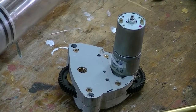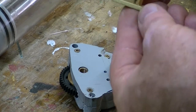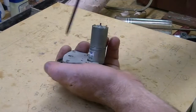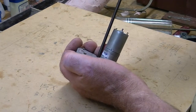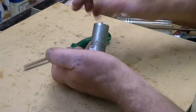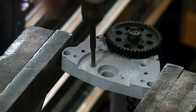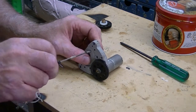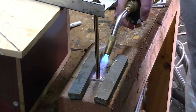It's all about arranging the start and finish stops for the piston. Good idea to clean the lathe between instances. A new motor is bolted on, and a piece of brass has been made to hold the tube with the slot. Thinking through how to hold that tube onto the back of this gearbox, which is currently holding together with the equivalent of brass wood screws. Threading is now put into the slots on the inside of the gearbox — put a bit of glue on a thread, screw it in and it will never come out. Bolting the thread-holding mechanism onto that.